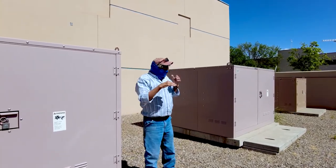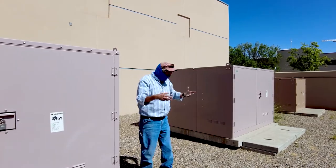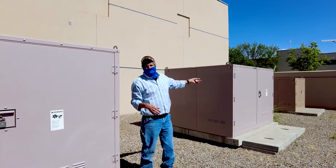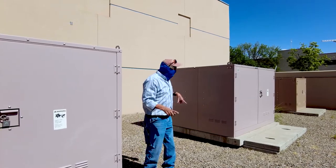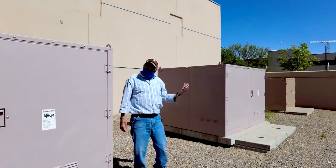It would take about, well, not my crews, but the electric shop guys, about an hour and a half to fill that up with $3,000 worth of SF6 gas. And then we could switch it. So if it was an emergency, it took an hour and a half to fill it up with gas so I could switch it.